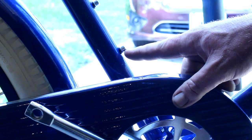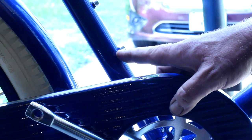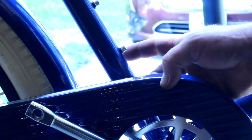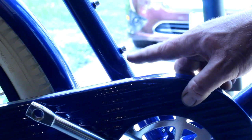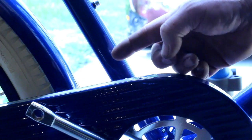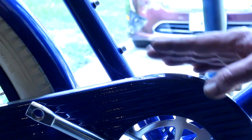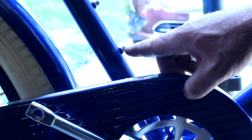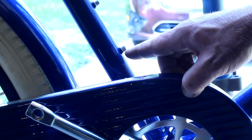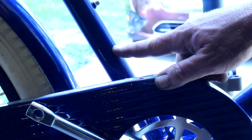This screw right here is going to be in the way of the motor mounting. It has a washer that's welded onto it and it's threaded inside. What we're going to have to do is grind that off. I'll go ahead and leave the screw in the hole so it fills up the space and is less likely to crack. I don't want to grind into the metal — I just want to grind off the allen head part of the screw and the washer so everything is flush with the round tube and not extending beyond it.